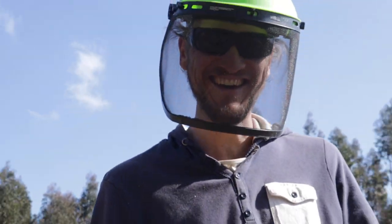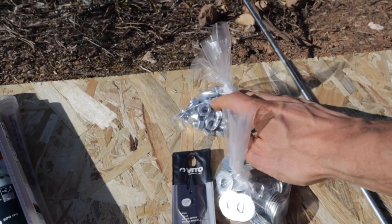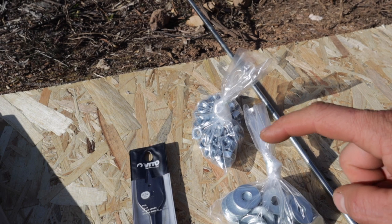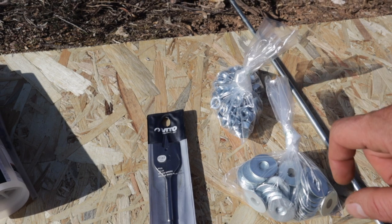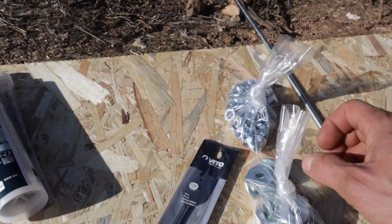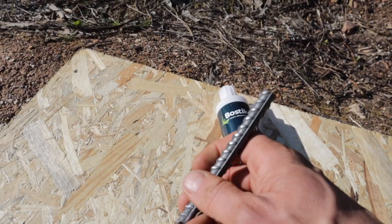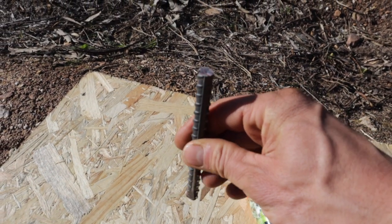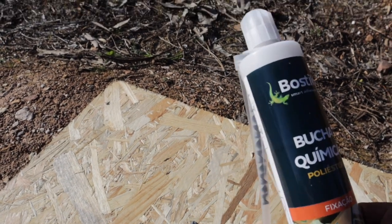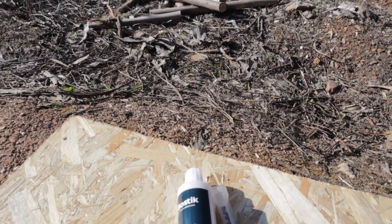Almost an instant fit — I like it! I did a bit of shopping: I got some parts of threaded rod, nuts, and rings. I intend to use these to bolt together the main octagon shape of my yurt platform. I also got an extra drill bit so I can countersink the rings. I got metal rods to use for the footers — I hope to plunge them into the stones placed on the ground, then place the wooden legs on top. I also got adhesive to attach the rods into the stone.